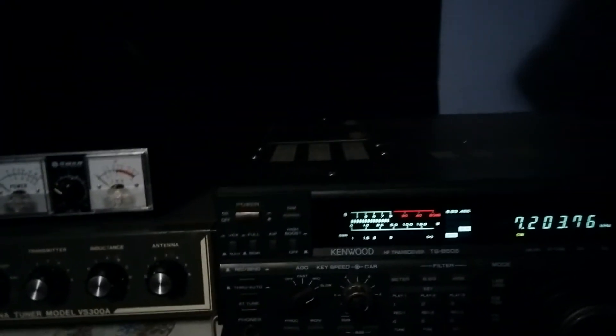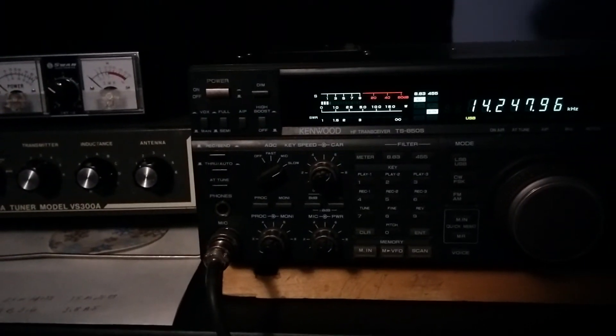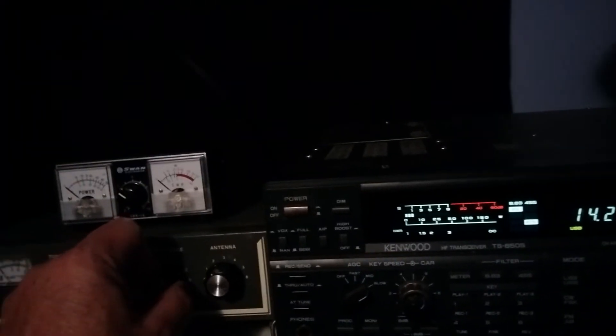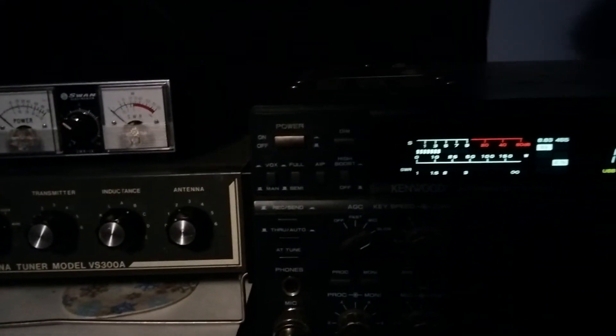You can see on these lights now how the forward light is illuminated but the reverse is significantly brighter relatively speaking. The SWR on 40 meters is quite a bit higher because a half-wave dipole on 80 ends up being two half-wave antennas on 40. The impedance at the end of a 40-meter half-wave dipole is very high, so you won't see as good an SWR — but with balanced line the losses just aren't as high as they would be on coax.